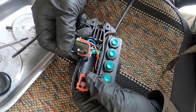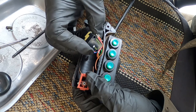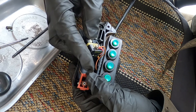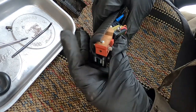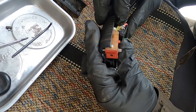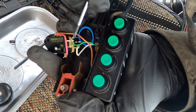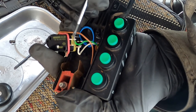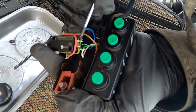Let's do the visual inspection first — visual is key. Let's check the switches for loose or broken wires, rusted or corroded connections, and check the soldering. Here we go — see this green wire? That wire broke loose inside the pinhole and the soldering doesn't do anything, just hanging in the hole.